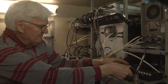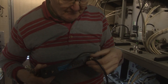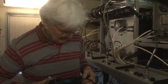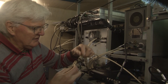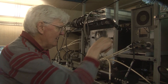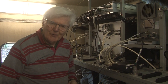We're going to wire the bodge box into the aerial lead. This is the RF output - it has Belling-Lee input and output sockets. That one is marked RF in, so we unplug this, which is effectively our down lead, and connect that on there. Now I've got to create another lead to go from there to there, which will take a little bit of rummaging around, so I'll be back in a moment.